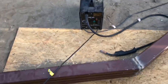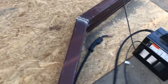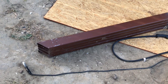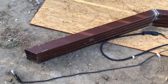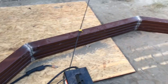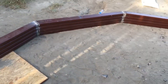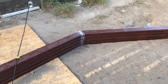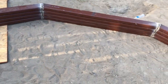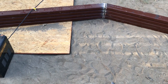Right now I'm going to go ahead and weld the brace. That's where I'm going to weld it to the actual leg or the post of the garage. I'm going to put a brace from that joint right there all the way over to that joint right there just to give it a little more strength in the middle. Then I'm going to put a small brace coming from the top to the brace going across. Let me go ahead and cut that brace and get it welded on.